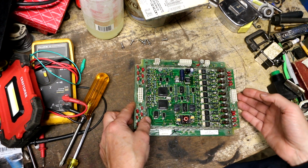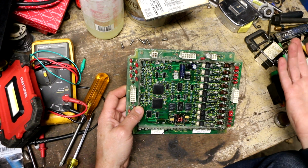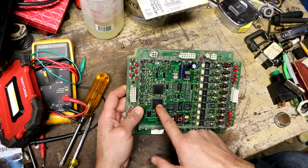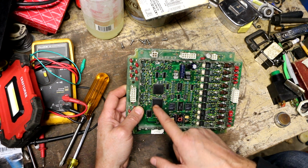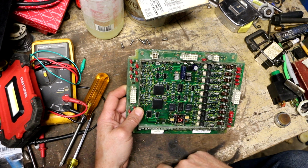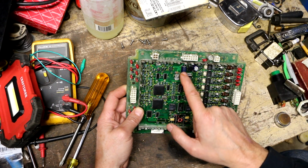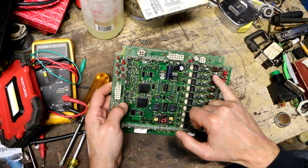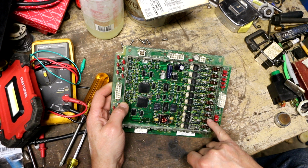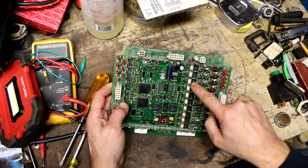Oh, there's a lot more going on inside here than I expected to see. Woof. Oh, yeah. Expected to see a CPU, and I would have guessed this was the CPU, except for the fact that there's another one right here that's identical to it. So are there 2 CPUs in here? Got a couple of electrolytic capacitors inside here that I didn't know were in here. I thought that was the only electrolytic on the whole board, actually, but nope. Got one there and an axial lead one there. Got a bunch of Allen Bradley style carbon resistors here. And a whole bunch of heavy looking diodes. And then there's the transistors I was talking about.